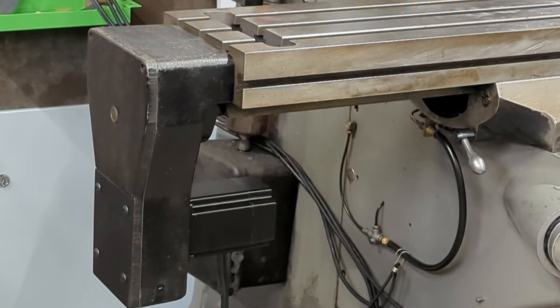I was able to modify the housings by machining a pocket on the back side. Originally the motors hung out on the outside — to the left of the screen — out in the workspace where I'd have to walk by them all the time. When I decided to upgrade, I flipped them around to the back side. Fortunately the stepper motors are short enough that when I run the table all the way to the right, I have about an eighth of an inch between the back of the stepper motor and the casting of the knee, so that worked out pretty good.